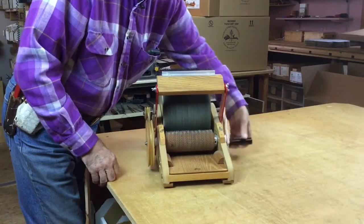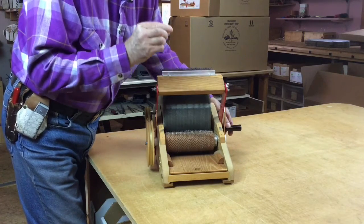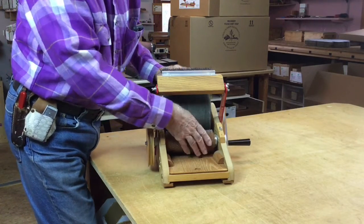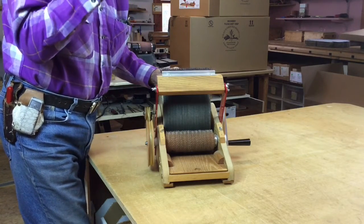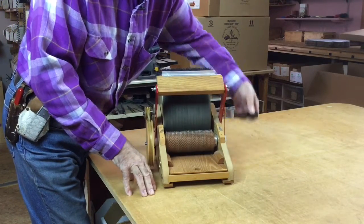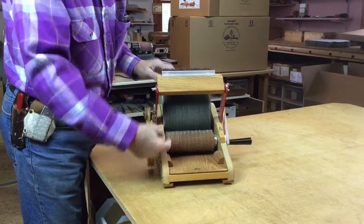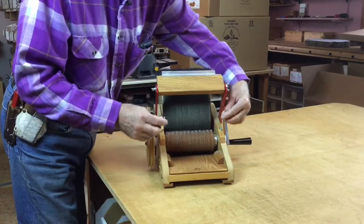Now when you crank, nothing. If you hear an occasional click, that's okay — you're the proper distance. Because remember, you've got lots and lots of pins on the little drum and the big drum. All these pins have been carefully machined so they're even, but there's always one or two pins that are a little bit longer. That's sometimes what I listen for when I build them in the shop — that's what you should hear. Make sure these are finger tight. Do not use pliers because you'll break off the wood. That's it, you're done.